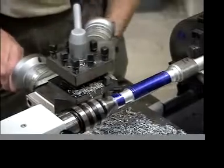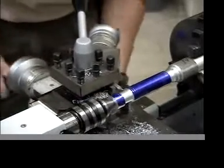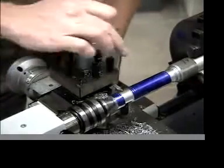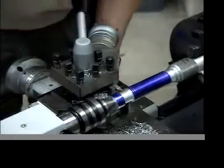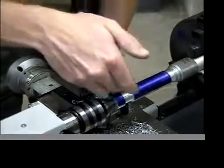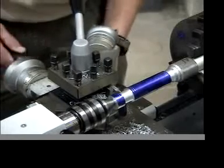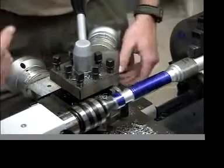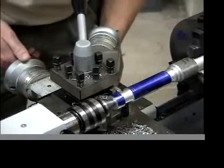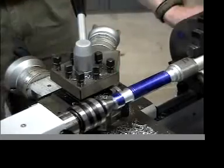What I'm going to do here is look at my lines now, and I'm going to come in on a diagonal until I touch that surface. So I have a 45-degree angle coming away from that surface. And the easiest way to do it, I like to do it, is to come in almost touching at point 8 and then feed back away from the part. And that way is a lot easier. That way you don't go too far. So I'm going to turn it on here.